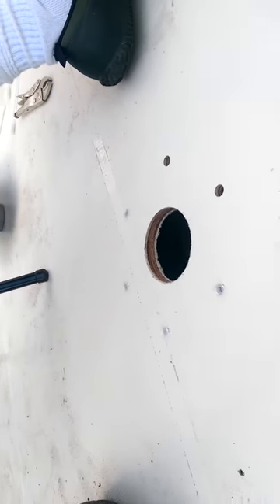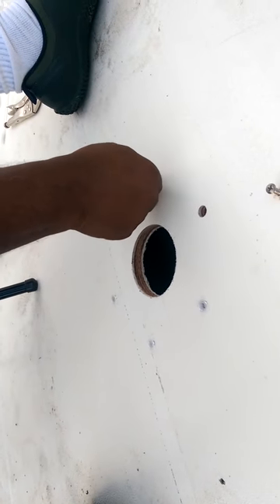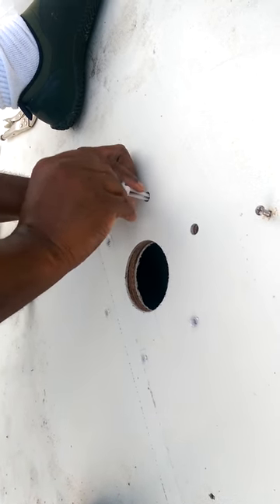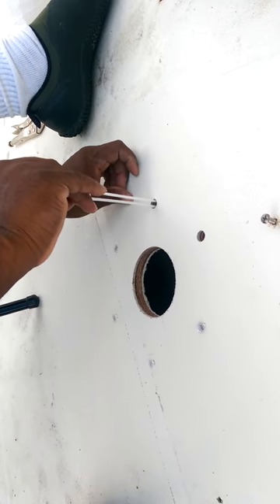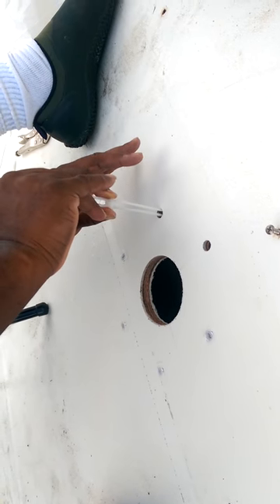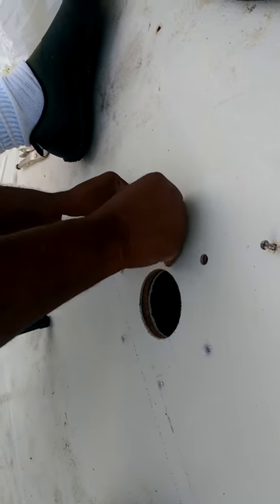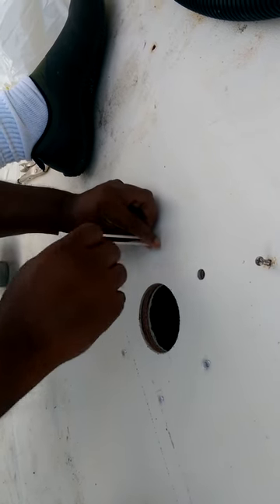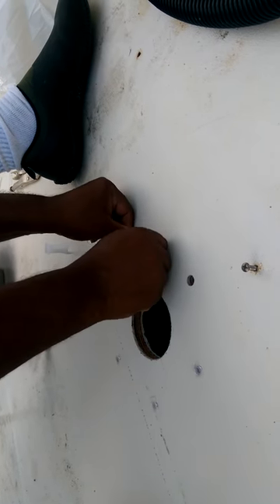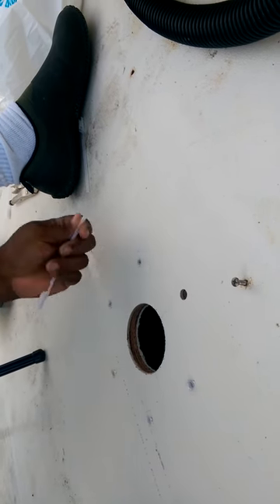I'm going to try one now. We've put in several and they've been working so well so far. I'm going to try one more. These are half-inch holes that we pre-drilled and we're sliding in the toggle bolt, making sure it's flush, holding it steady, being very careful before we start to slide the plastic piece down. I like to get it and then press the base into the deck, make sure it's flush, then hold it tight and pull it back up so that it's all the way down. Then it's as simple as breaking it off — and there you go.